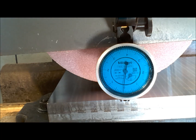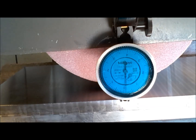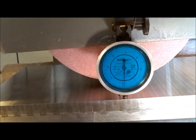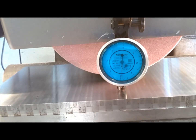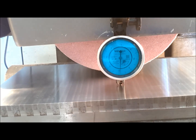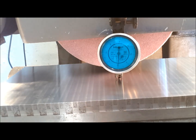I'd say this mag chuck right now, the way it sits, is plus or minus a tenth. The worst one we saw was about one and a half increments, which is so minuscule it's not even funny. I'm calling this good — I'm not going to do any hand work on it. Those little scallops over there I'm just going to live with. This mag has been reseated and we've got a fresh start on the top.